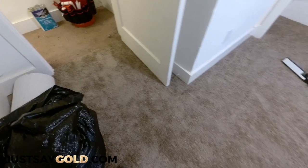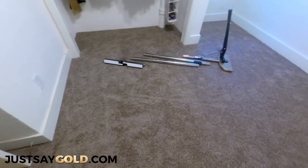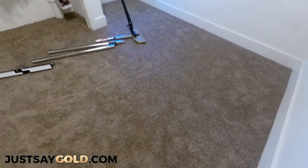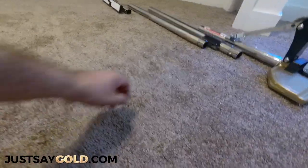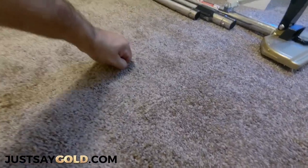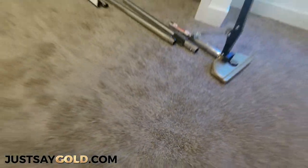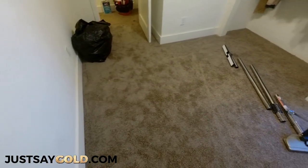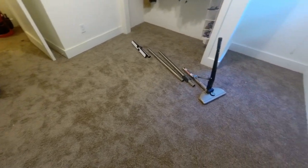The carpet's a little bit different because the carpet in the hallway is an old nylon carpet, and this is actually a PET polyester, so it's not going to last as long. But it is a rental, so it is what it is. There's my power stretcher — I power stretch everything nowadays, even if it's builder's grade carpet. I only use my knee kicker maybe to bump something here and there. But you've got to get used to using a power stretcher if you're doing installs — it's just so much better on your body.